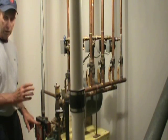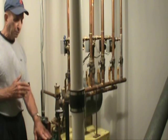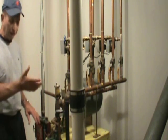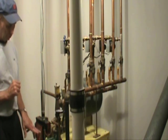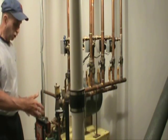At that point, if the boiler is not already off, it will turn off. However, the circulator pump will continue to run until the temperature drops below approximately 165 degrees, at which time the zone valve will close and the light on the right-hand side will go out, and everything will turn to what we call neutral.